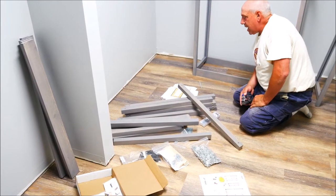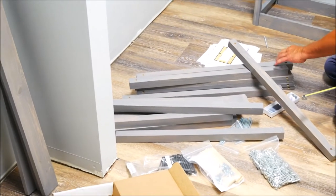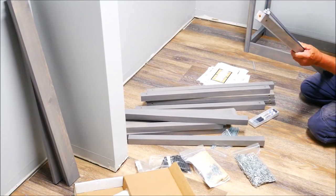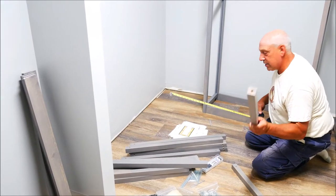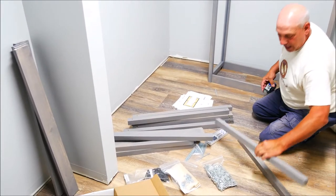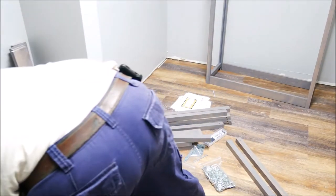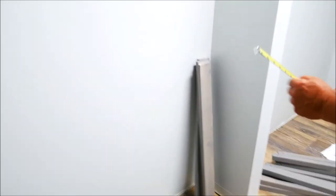By following our drawings, we have to determine we have 30-inch width shelves, 36-inch width, and 32-inch width. So we want to separate all of our framing pieces so that we don't put the wrong one on the wrong shelving. You would expect that your framing piece would be the measurement, however take into account that the outside of the frame is based on the total measurement. One is 28.5 inches — that will make up a 32-inch frame. Our long ones are 34.5 inches — that will make up a 36-inch frame. So we're going to separate everything so we don't make any mistakes.